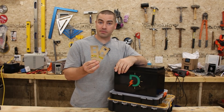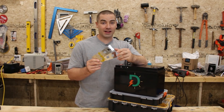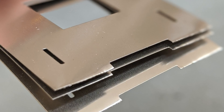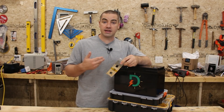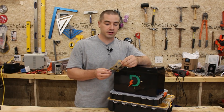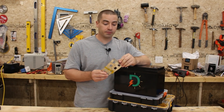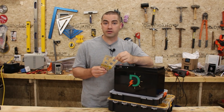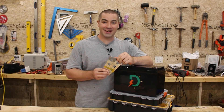Is this pure nickel strip or nickel-plated steel? There's a lot of fake nickel out there — nickel-plated steel that's advertised as pure nickel. I purchased this from 18650cellholders.com — that's Keith's store. Keith is down in Rhode Island and since I live in Massachusetts I've driven down and met him in person. I trust Keith and I think this is pure nickel because he said so. But I'm going to cut some up, put it in salt water tonight, and tomorrow we'll check back and see if it has rusted. I'll put that footage in at the end of this video.